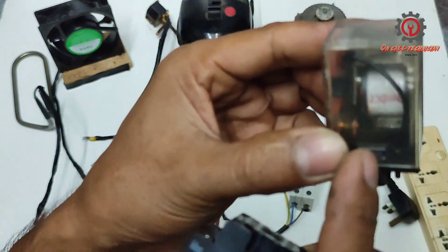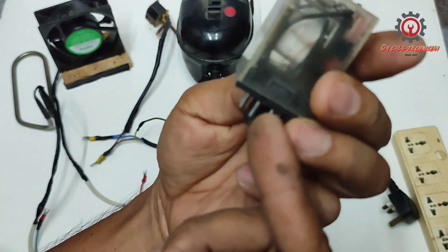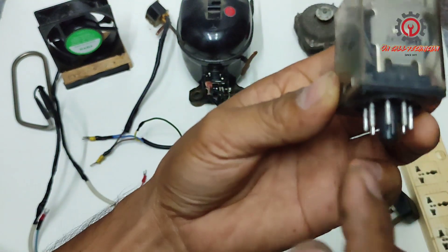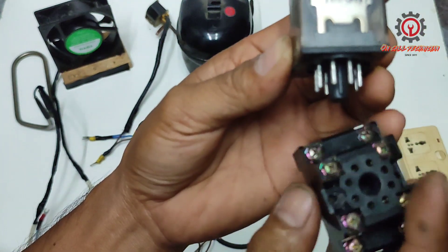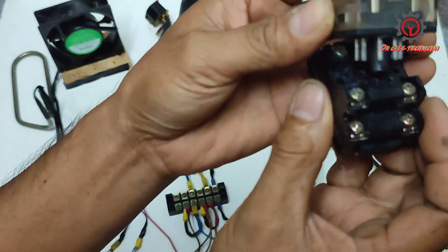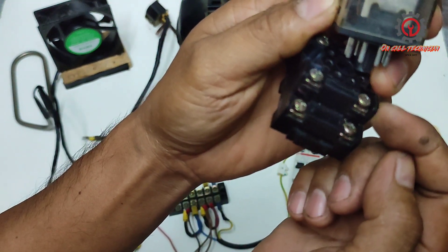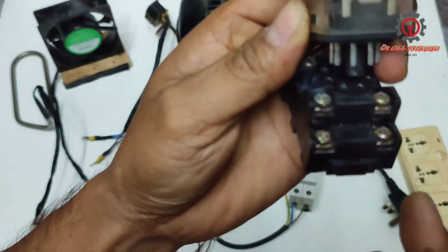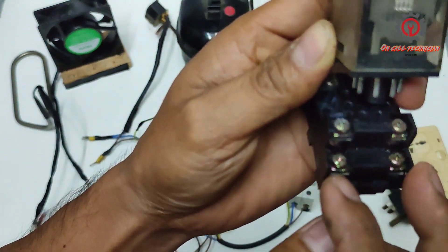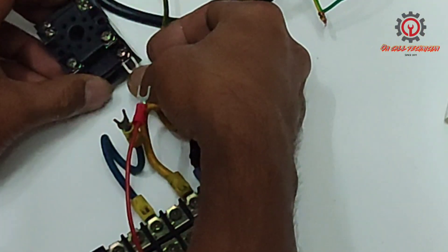If you look inside, this is our coil and the opposite side is here. So terminals two and seven — facing toward us this will be coil one and coil two — and this side here is the incoming supply.